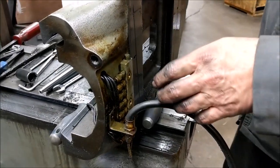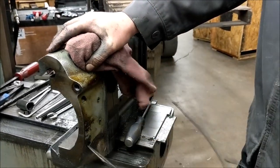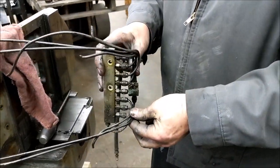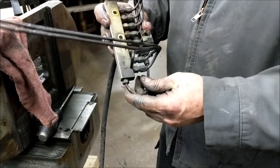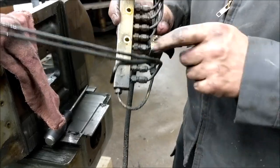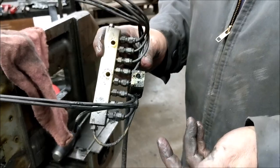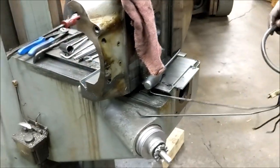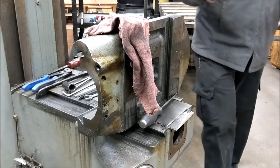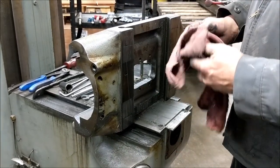With one hand hold onto your saddle, and with the other pull your lines out. You'll notice three lines to the back and five lines to the front — the meters are all numbered. Just be careful, take them out and replace them with the same number, or you can just go with number ones and it will work just fine. We now have the table and the saddle off — we will now be working on taking the knee off.